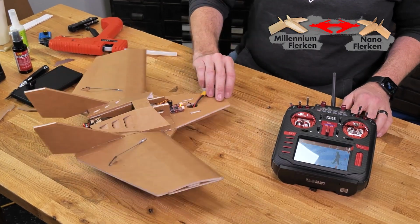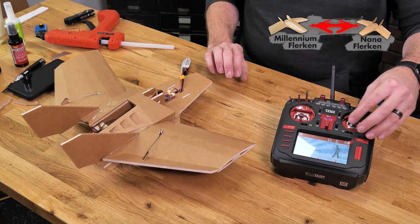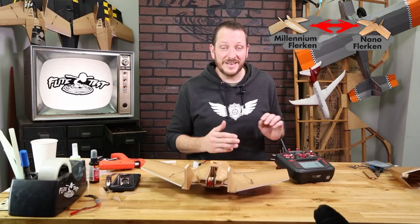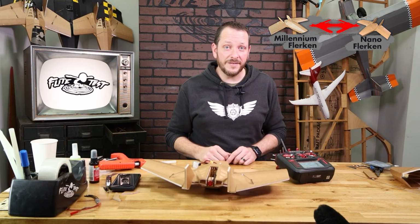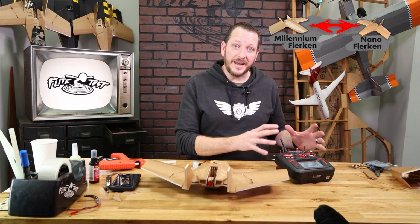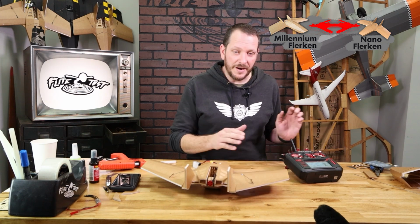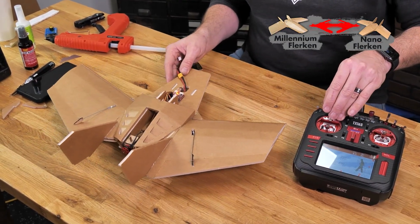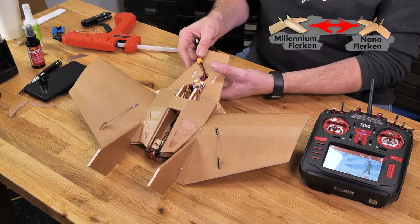All right, at this point you're going to see that we have control. We have ailerons and we have throttle, but we do not have elevator, and that's for a good reason. We need to put this in elevon mode. We do not want to make any additional changes to our Radio Master. Everything we're doing is now going to be done through our FTOR 5. I'm just going to switch my channel 5 switch so we don't hear the gyros chirping while I work with it.